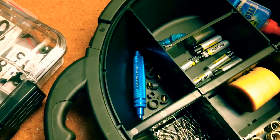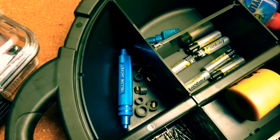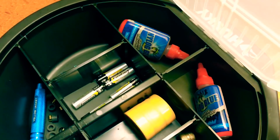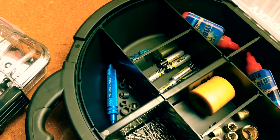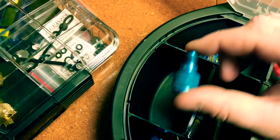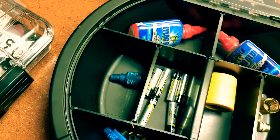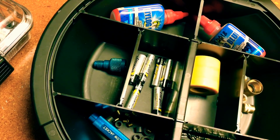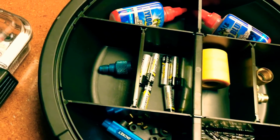Inside the small parts bin: some extra batteries for the micron gauge; Yellow Jacket's gasket removal tool with a little hook inside the blue handle that makes it easy to change gaskets and depressors; three-eighths and quarter inch gaskets; some schrader cores; various sized caps; some Nylog to make sure everything's leak free; a solenoid magnet for during pressure tests so if I have a system with a solenoid I can make sure I'm pressurizing both sides running only one hose. There's also a small orifice fitting from Yellow Jacket that lets you charge refrigerant as a liquid and helps meter it out to avoid slugging the compressor.